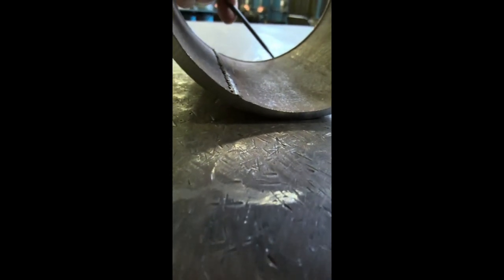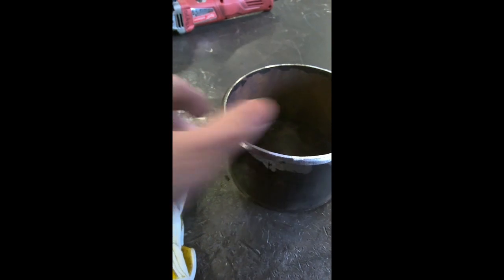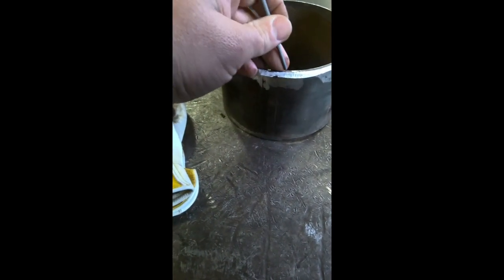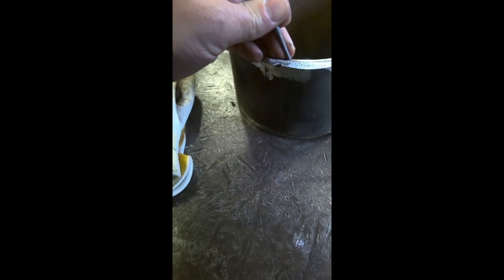So this is our beveled coupon. We make these sometimes in the shop. You can see when it comes out of the pipe cutter, it leaves a small lip on it. If you look down through the other side, you can see it a little better — that little lip right there is what we need to grind out. We want to make sure we get that out of there, that's got to go away. We want them smooth on the inside like this. Eighth of an inch landing — let me take this here, set it on there. That's how I check my lands. Eighth of an inch, that's what we want.